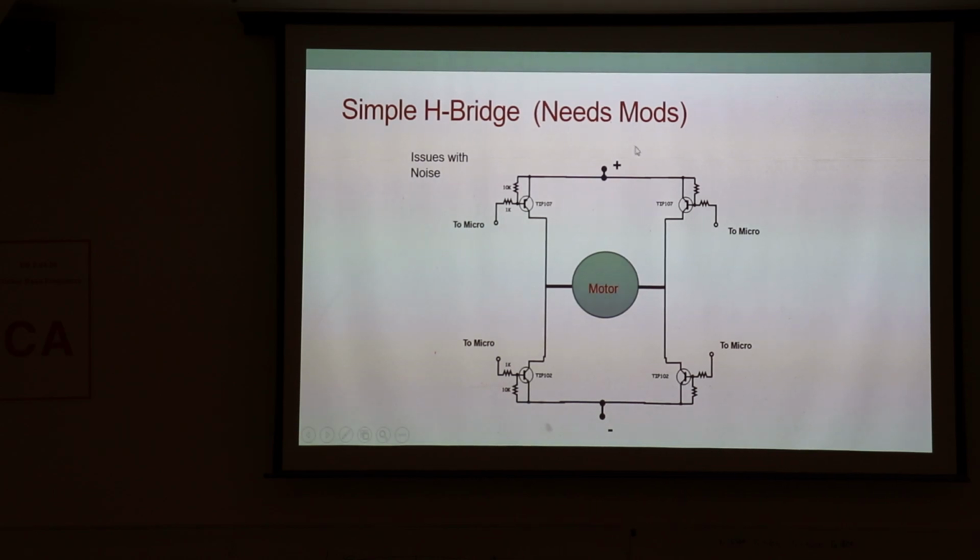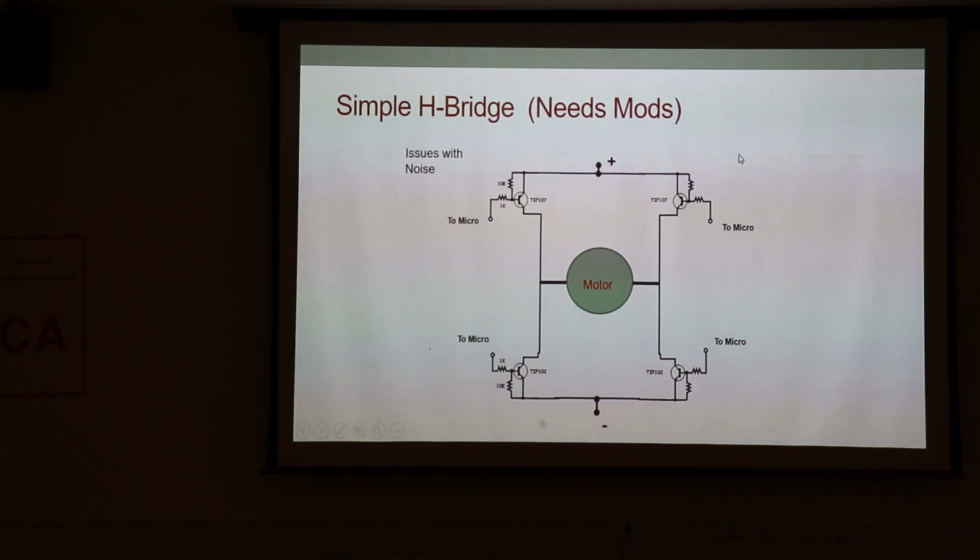And so what happens is, with this H bridge, you have the tremendous advantage of being able to run the motor either direction. And if you use PWM on these switches in just the right way, you can run it either direction at a whole range of speeds. Now, the basic function of it, and I'm not going to cover it all, I think I'll quit in just a minute, but I want to do the basic part here. In the basic function, there are really two main things.